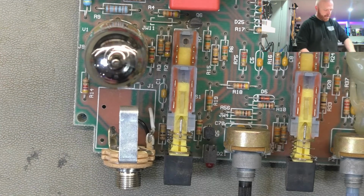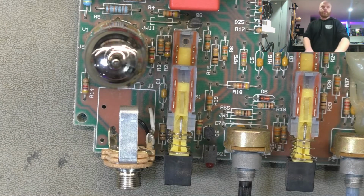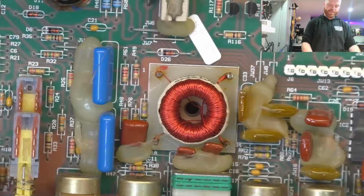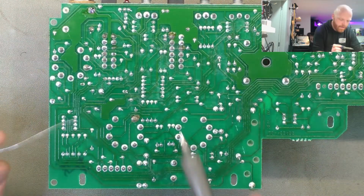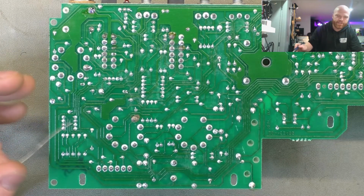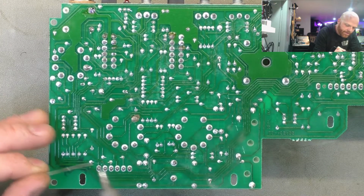So the jack was a little bit hard to push in. Plug was a bit hard to push into the jack. Got to be precise about these things. So I just noticed a few little half moons starting to develop around the headers. So we'll just reflow them.